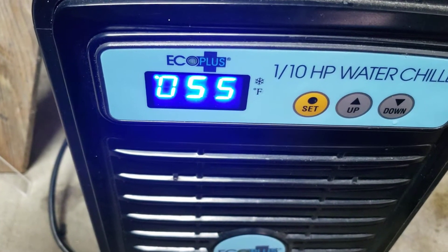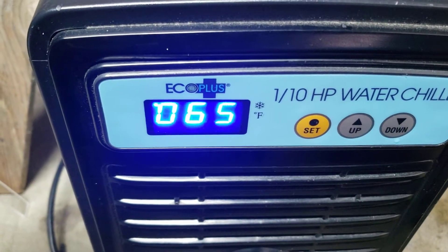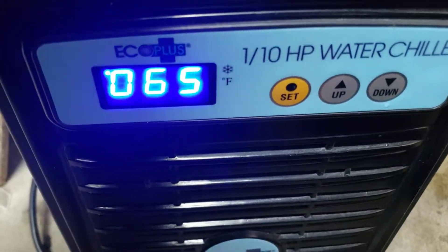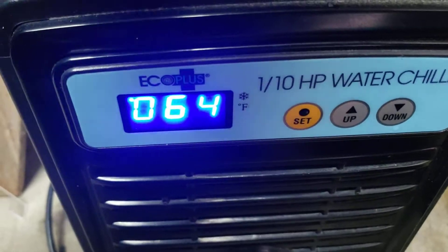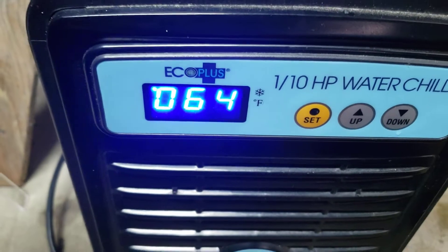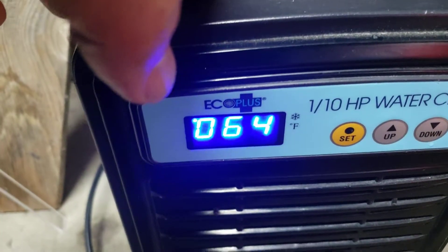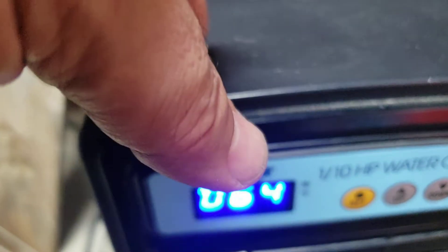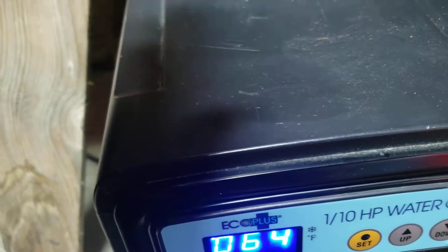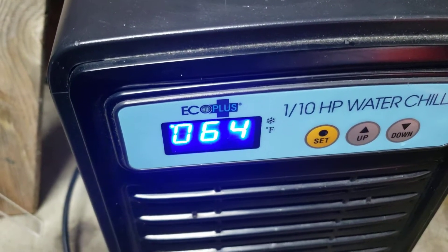The set temperature is 55°F, which is pretty cold. The laser will run about 17 degrees C with it set at that if I'm running it continually. You sort of have to play with it — it depends on the climate outside. Today's about 19 or 20 Celsius, so a little bit cool.